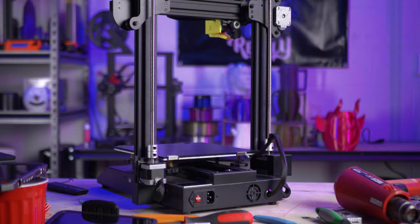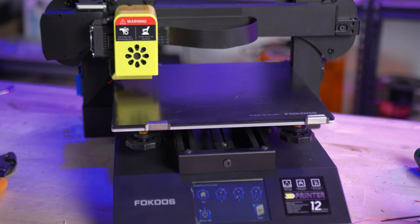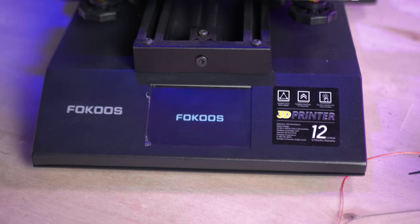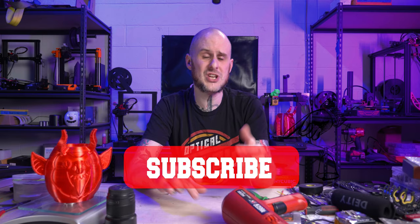Real talk about why I chose that machine: it's the only other machine I have that has dual Z-axis lead screws and stepper motors to really hold the X-axis gantry in place. Also, the Y-axis rails are set decently far apart for a stable bed platform, and the X-axis gantry is 40 millimeters wide to really have a nice stable hold on that direct drive extruder. Quick side note — this video is not sponsored by the folks at Focus Tech. That machine was provided to me by them, but this is not sponsored. If you're looking to hear some negatives about that machine, get subscribed, because I do have some thoughts and will be reviewing it in the near future.